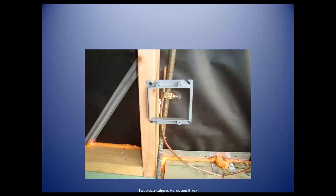In this new construction, here's fire foam sprayed between the gap of the bottom plate. That's supposed to be pressure-treated wood right here — and here's the pressure-treated wood and the anchor. There's diagonal bracing — not sure why — and there would be sheathing there.